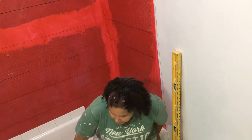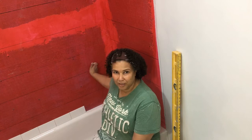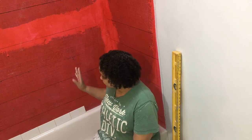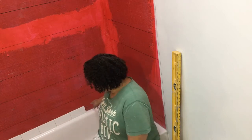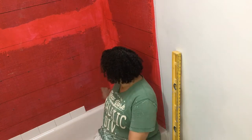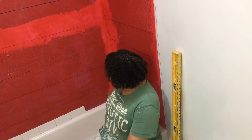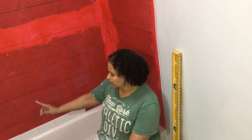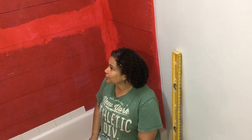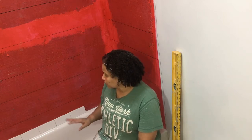I'll start with the full piece over there, but I did check it first because sometimes if you lay it out that way you end up with a tiny sliver at the other end that's really hard to cut. Rather than trying to measure everything, I just lined up the tiles to see where they would fall at the end. It ends up being almost the same either way, and it's much easier to start on that end because you have fewer cuts.